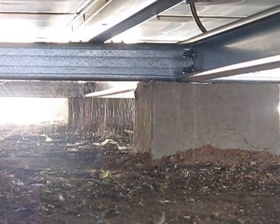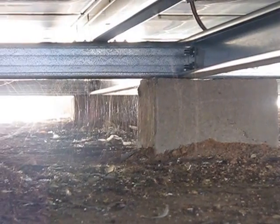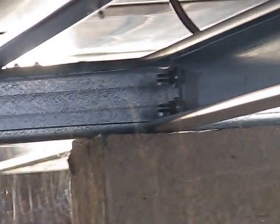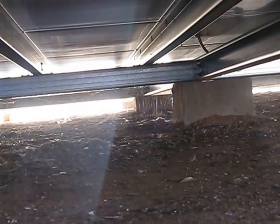They're recessed into the ground to give them a bit of strength, just like a stump, but they're basically just hand poured, boxed off, leveled out. You just put a whole lot of blocks on the ground as you would sit your container on, and that's what this sits on. Now you'll see up above it the steels that are there. The steel that sits directly on the block is just like your orthodox bearer. The steel on the bottom that sits on the concrete blocks just spans from block to block right around the whole build. This is a dead rectangle, so it was pretty easy to lay out.